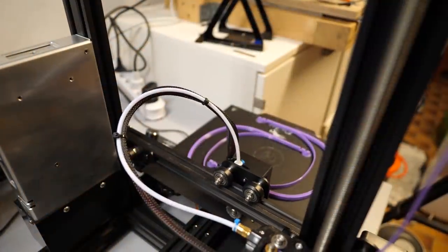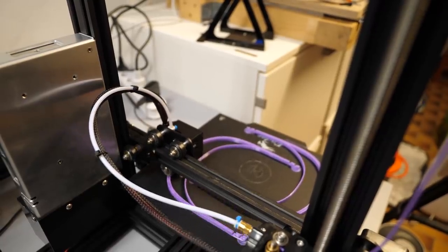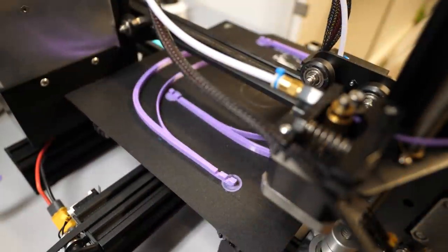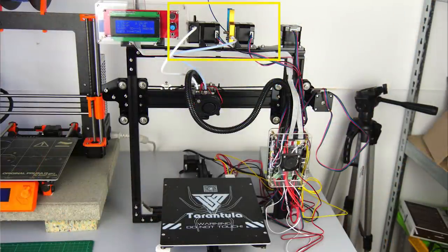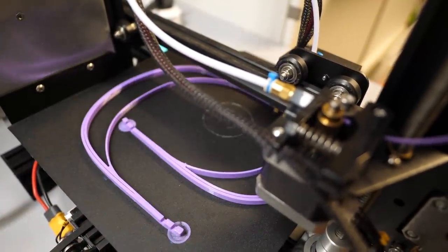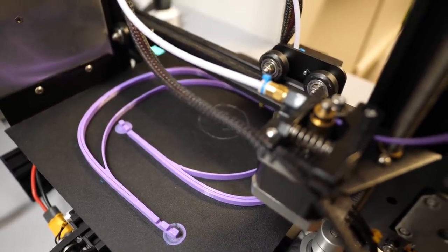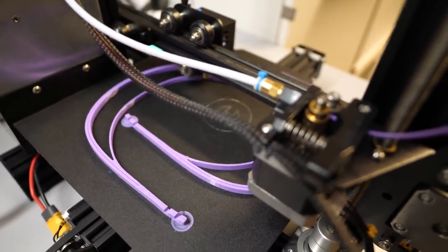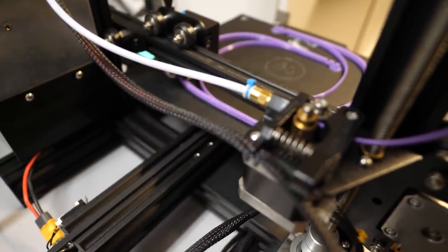These Bowden printers have a lot of friction in the Bowden tube that limits the maximum flow with a standard feeder quite a bit. If I had more time, but didn't want to invest in new hardware, I might have moved the feeder to the top of the printer so that there is almost no bend anymore in the tube, and also increased the stepper current a bit, just until it started grinding the filament. Also using a 0.6mm nozzle on all machines might have enabled me to print even faster, because that reduces back pressure.